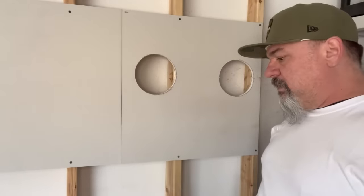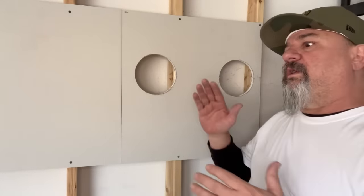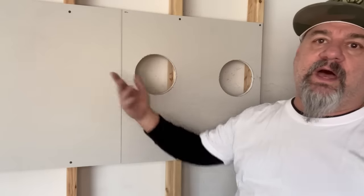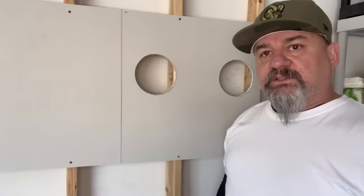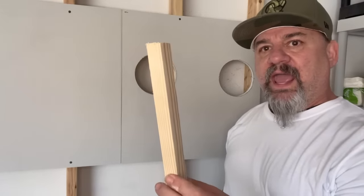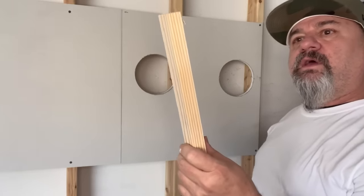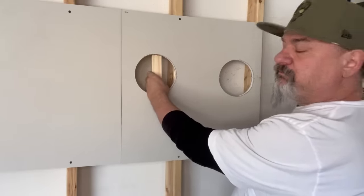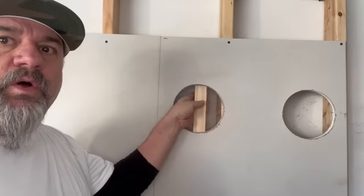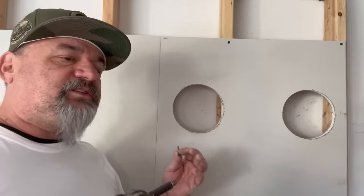Let's get to the patching part. Because we're nice electricians, I do this the electrical way from an electrician's standpoint. I'm not going to get drywall knives out and do the smooth transition — I'm going to show you how to patch this, the way I do it, and leave the fine finishing for the pros. First, we get some backer board — one-by half or what have you. If the hole is six inches, cut it a few inches past it, because we're going to have to grab onto it and drill into it. Always use coarse drywall screws — they'll pull the wood in rather than you pushing on it. If you use fine screws, you'll just be pushing through the drywall.